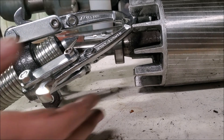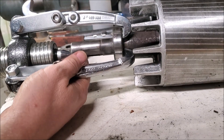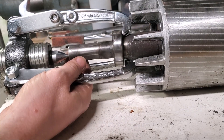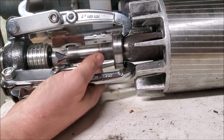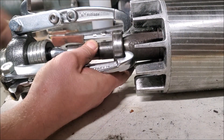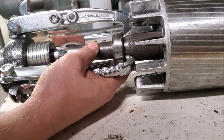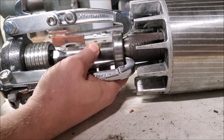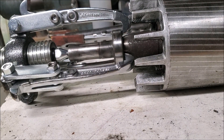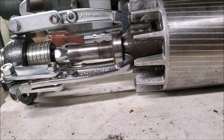I'm going to try to line up the puller on here. It's got little jaws that go around the bearing and it's got this point in the middle which sits in a little divot in the front of the shaft. It's got five tons of hydraulic force which makes it really easy to come off. The jaws on here are actually from the pullers that I broke trying to get the pulley off. These aren't really rated for five tons, but the jaws that come with this device are too big to get around the pulley, so we have to improvise a little bit.